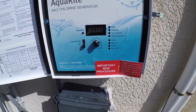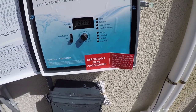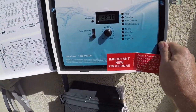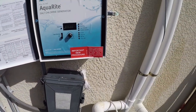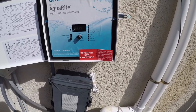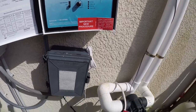2800 is good, it's a little low. Just FYI, when you first turn it on, it's going to say 'no flow' — that light will be flashing. That's only because there's a time delay. Once it establishes flow and after the time delay expires, then the light will go out.